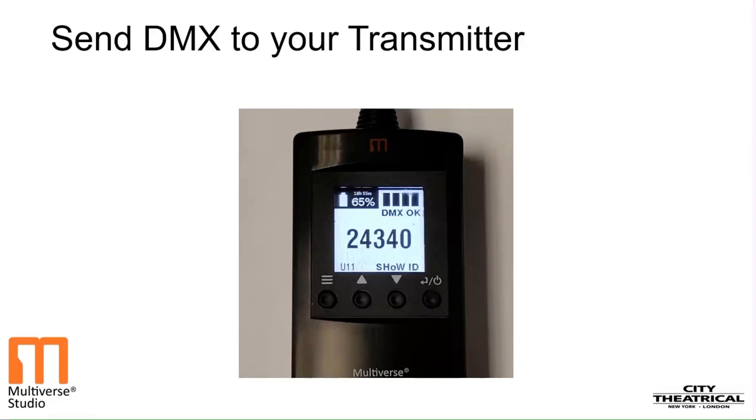To improve signal quality, you can improve the placement of your transmitter or receiver. Remember, higher is better. And check that your omnidirectional antennas are vertical and parallel to each other. If those actions don't help, sometimes specialized antennas, such as panel antennas or Yagi antennas, can. Nearly all broadcast problems can be overcome with specialized antennas. And you can check the index of our previous webinars to learn much more about antennas.